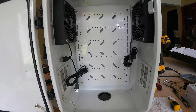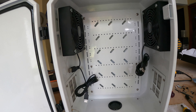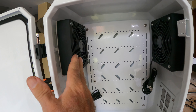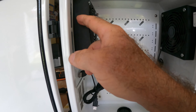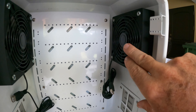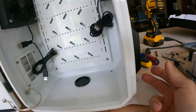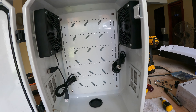The hardest task in this whole project is installing the fans for the AC Infinity cooling system. I was able to do it and it wasn't as difficult as I thought — I just had to do some machine skills. This is a push-pull type of system: it's going to pull air in from the vents on the bottom as well as the vent on the side, do some cooling inside, and then push the air out through the ventilation here. Any positive pressure buildup can also exit through the bottom or the sides.